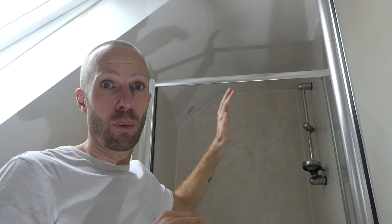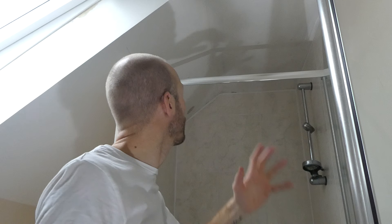Here's a little tip: if you're doing any painting and you've got a stain that just keeps coming through, grab a little bit of PVA on your finger, smear it over the stain, make sure it's not thick and blobby, let it dry — and the stain is gone. We've got two coats of PVA on the ceiling now and it is properly sealed — feels nice and smooth with a little sheen to it. I've decided to put a bit of stain block on the ceiling because there are patches where paint has completely come off down to the plaster and some of the black mold has really stained the ceiling. The PVA has covered the stain, but I want to use the stain block more as an undercoat.